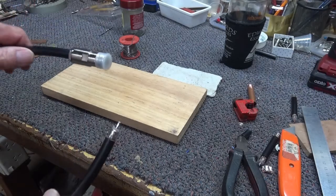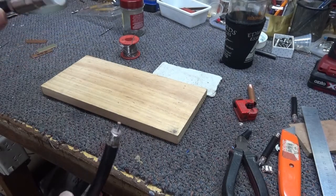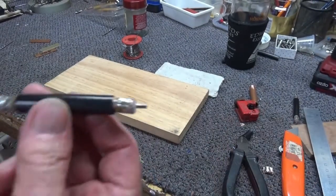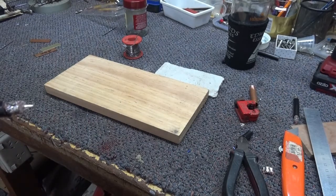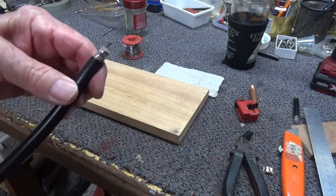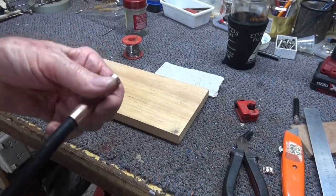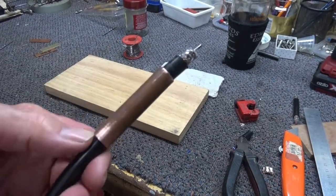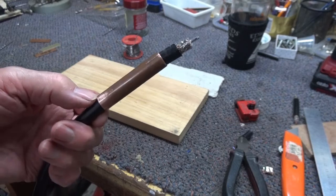I've finished preparing the end of this feed cable which will connect to the antenna. I've prepared the end the same as the short stubs, so they'll be joined up in a fashion I'll show you shortly. The next step is I'm going to put on a balun copper sleeve — this is it here. And this will go down here at a specific exact distance, and solder down here. This is to prevent RF coming back down the coax.